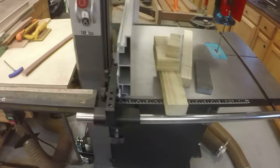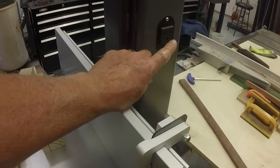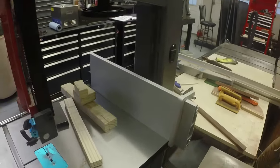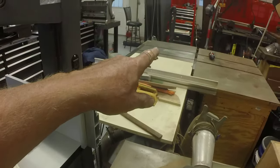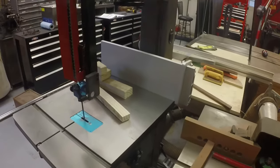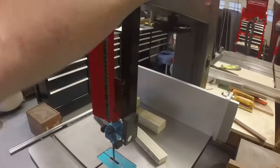It is 220-volt only. I have 220 service here so that's no issue. It does provide an additional 240-volt outlet for a work light. I looked at the wiring diagram and wondered if I could plug another tool into it. I have three 220-volt tools on a drop with only two plugs - the shaper, the bandsaw, and the table saw are all 220. Looking at the wiring diagram, there doesn't appear to be any breaker or fuse on that outlet, so I think it would work okay.